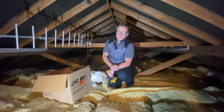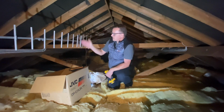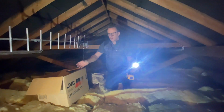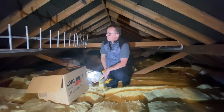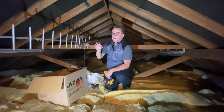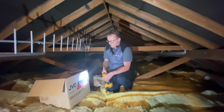Most normal estate housing would be truss rafters, where we'd have trusses at normally about 600 millimeter centers. The trusses with the two braces that come down and go back up are the most common. They are called Fink style. But what we have here, being cut and pitch, is the rafters and the purlins and everything need to be sized suitable to the spans which they're being subjected to.